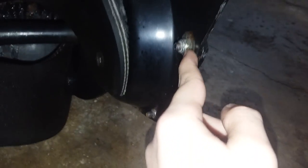Next up, your drive belt. The drive belt is so when you pull back that bail, there's a spring that engages this, which has a belt and a pulley system that turns the auger, which throws your snow — more or less. This will become worn and stretched out over time, or it might just snap randomly in heavy snow. To change it, it's not very hard. You've got one bolt right here, two, three right there, and then on this side you've got two bolts, but you've also got nuts on this side, so you have to hold them with the wrench. Then you pop the cover off and the belt's there — it's pretty simple to change.